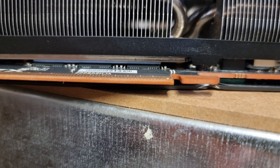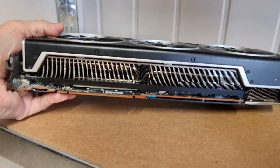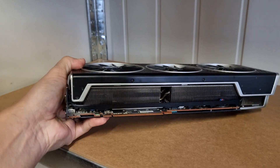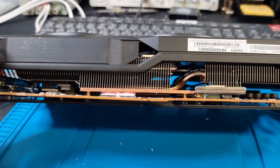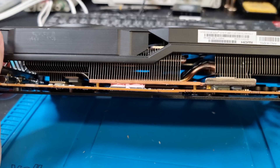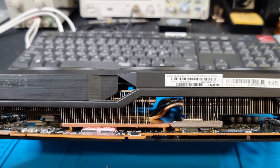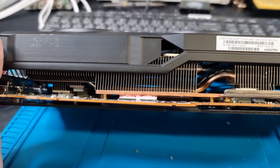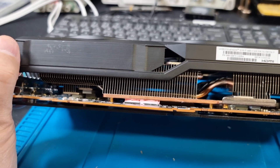These two memory chips need to be replaced — or reflowed, probably just the latter. Otherwise the card is perfectly fine, but it's been installed horizontally for so long that the PCB is just bowed. You cannot fix this warping. When you go back and take your card apart and try to use the recommended thermal pad size near the PCI slot area, those thermal pads are not going to fit. And please don't stack pads — don't add a 2mm pad plus a 0.5mm pad. That is just asking for trouble.